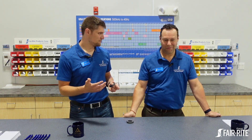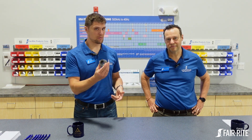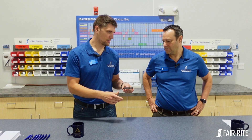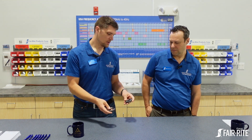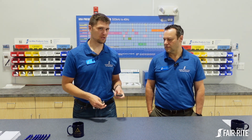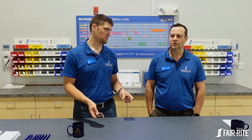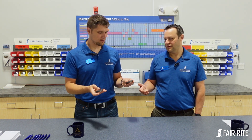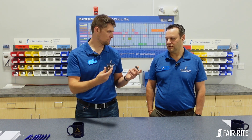Kind of, but not really. These look identical — they likely were made on the same press tooling. It's not actually the case with these two, but we can pretend they're the same material. You'll have 59 cores and 26 cores in our part numbering system. 59 means toroid; 26 is a suppression core. But they're both in a toroidal shape — a tube, circle, donut, whatever you want to call them.